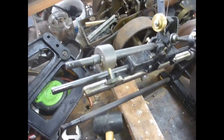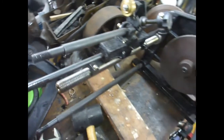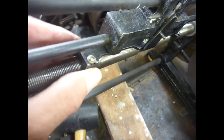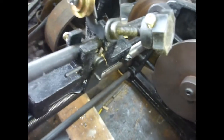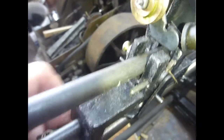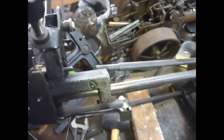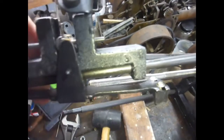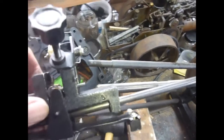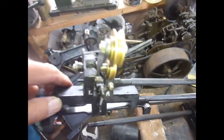Mount the machine on a block of wood so that this end is free. You have to remove the stops like that, and then you might have to lift off these half nuts from the thread — this will then slide off once it's free. You can slide this off; a bit difficult to do one-handed, but there we are. So there's the unit removed — this time it's come off with the bar as well, but it doesn't have to. You can slide it off that bar, so it's simply a question of turning it round and replacing it that way round, which is the normal way round.